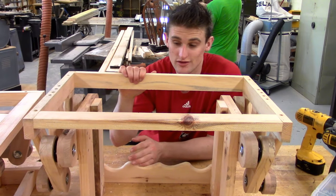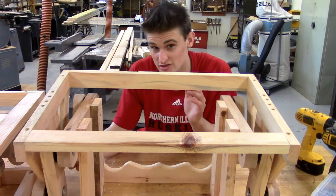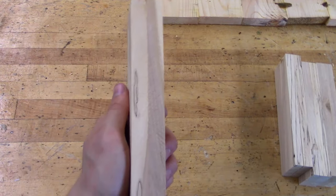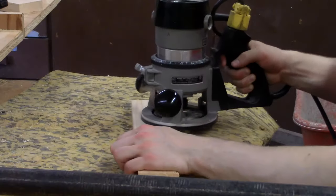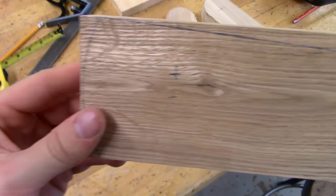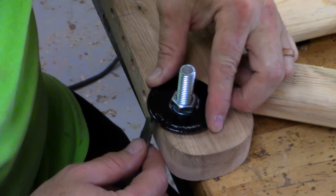So we're not actually going to skip over the entire process of us making the swing portion for our chair. There are a couple things that you need to know, but let me just recap them now. The main differences between our chair and footstool gliding systems is that one, we doubled the thickness of our swing arms so they could hold more weight. Two, we added designs in the bottom of our feet because we're fancy. Three, we angled and offset our horizontal swing arms so that we could create an angle with the back of the chair seat so that when you sat in it, it would automatically lean back, keeping you in the chair.